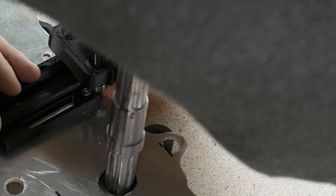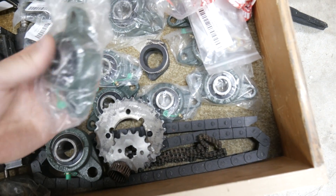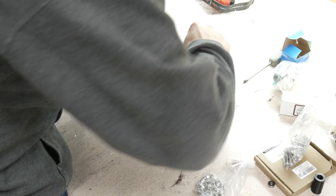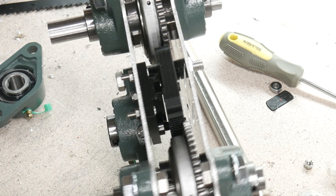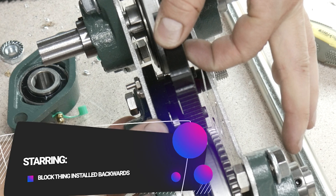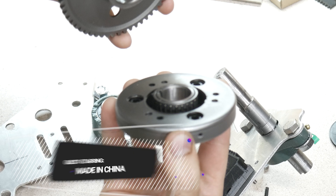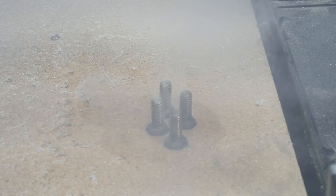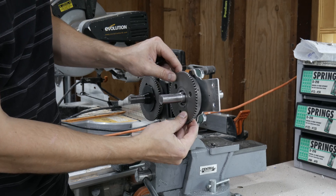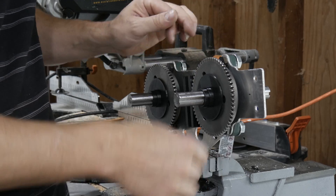First I assembled the rack mechanism - it slides up and down. Next I installed the bearings. I think these are 7/16th bolts. Put some spacers in there and bolt them all on. We got an assembled transmission - except not quite. There were a bunch of issues. I had to clear some holes and shave down the heads of these bolts so they don't grind against the one-way gears. To address the gears pulling apart in the middle of the transmission, I 3D printed a couple of caps that go around the shaft and act as spacers, keeping the whole gear sandwiched together.